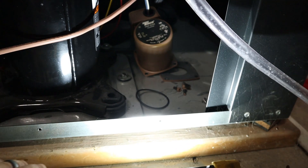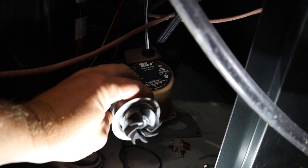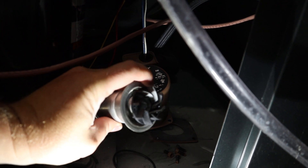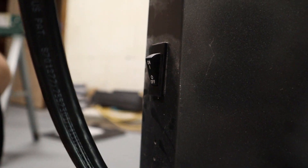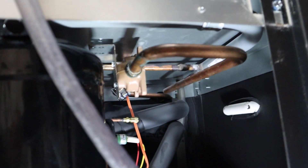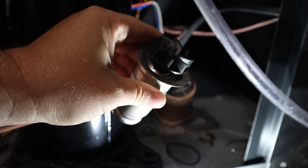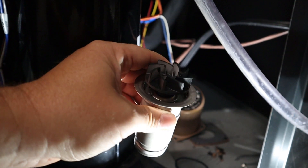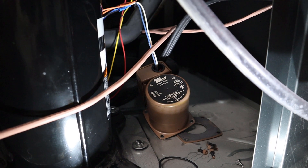From that pump it actually goes out the other side of the unit. I took mine apart just so you could see what it is — it's a little Taco pump, a 1/40th horsepower I believe. The nice thing about those little Taco pumps is they're very simple. They have these little cartridges that fit inside of them, so if your cartridge ever goes bad or the bearing seizes up, you can replace these — they're readily available. I ended up having to replace mine because I accidentally hit this little switch right here, which activates the de-superheater so the pump will actually come on. You don't want that pump to come on if there's no water in the system, because it's just running dry. That burned up this little guy right here. I had to change one out — it was about $90. That's way better than having to change out an entire pump, which is about $300.